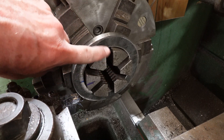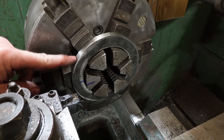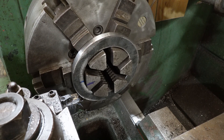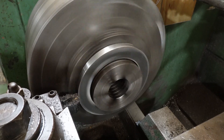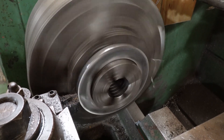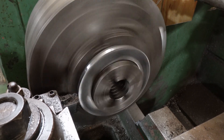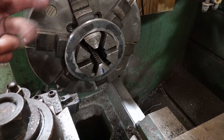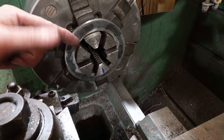I pushed the part fully back against the chuck jaws and we're going to cut from this side close to the jaw, then flip it over and do the other side — all this is for is so it fits inside the pipe, centered. I went and did a test and it's pretty much on size, so we're just going to go clean up these little burrs. There we go — that should go fit in our pipe. We're going to test fit this on the pipe, and once we know it fits inside, we'll expand the jaws and clean up the inside the same way.